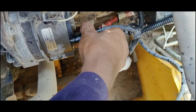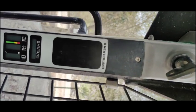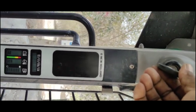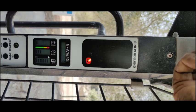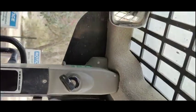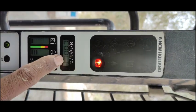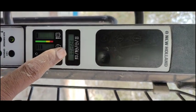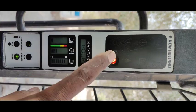I cleaned all the connectors with WD-40 and I hope this problem will be finished. Now the machine is on and the warning is no longer coming. I'm going to start the machine. Now there is no warning coming. The coolant temperature is 163°F and the RPM is now 2080 — so RPM is working good. My warning has gone.